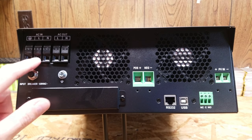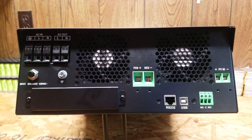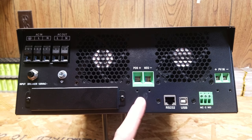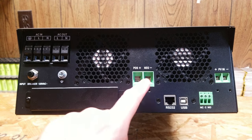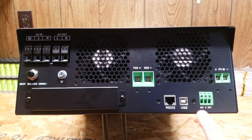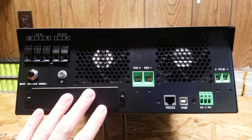On the top left, we have the AC input, ground line neutral, and the AC output, line and neutral. We have an AC input breaker - there's no rating on it visible from the front, but I'm going to guess it's probably a 50 amp. A chassis grounding screw. The battery positive and negative input. Now, with this inverter being over 100 amps rated current, I would have expected slightly larger terminal blocks. But we have an RS-232 communications port and a USB communications port. And we have a three-pin relay over here - common, normally closed, and normally open. I'm guessing you would wire this to a generator if you want an emergency generator to click on once the batteries are depleted. And then we have the PV input over here on the top right. It's all fairly standard connections, nothing too fancy or special here.